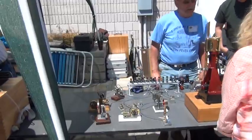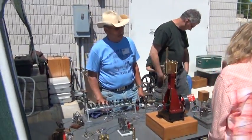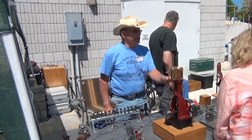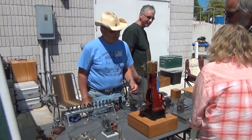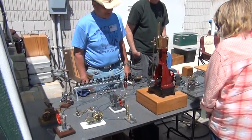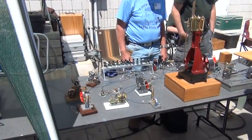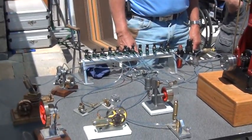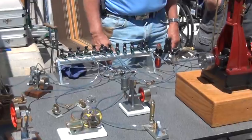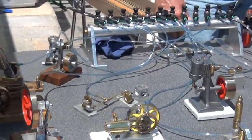Going this way, you can't assemble the engine from the parts from the inside out. When you pass this gear on, it's impossible to put this through in. If you put this through in, you can't get the gear on. The next drawing, okay, the screws are stacked up. See the threads here, this one is threaded in here, and this is threaded. So it's properly done, so this is a good drawing, this is a ball bearing.